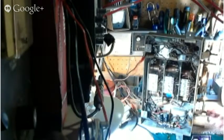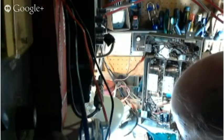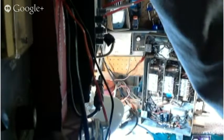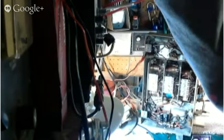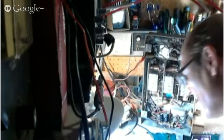Well, let's take it down to 600 and do like it says. Turn the tuner down to 600. Hey, how come there's a signal there? Kind of weird. Take it down to 600. I don't know why that was audible. Pretty close on the 600. Very close. Just make sure it's right on. Right on there. Put this right on 600. It's perfectly aligned, nothing to adjust there.